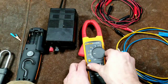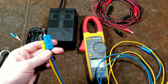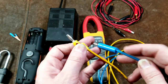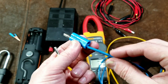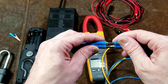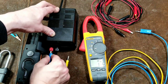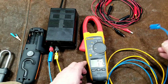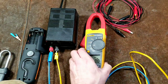I'm going to do a quick demonstration going through the voltages. I have my little Fluke meter and these Pomona cables, which are designed for hooking various electronic items up to power supplies. These are really nice because you can plug them in crossways or through the back, and this style cable has an output in the front and the back. You can plug two cables into each other and they have a really solid double connection. These Pomona cables are sometimes too tight — like any banana plug, some manufacturers really muscle them in. On multimeters you can plug banana cables straight into them, which I don't think a lot of people realize, but it's a handy feature.